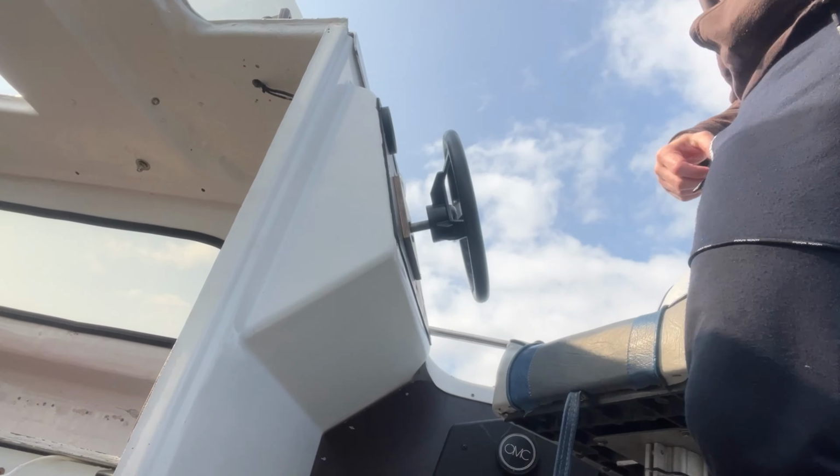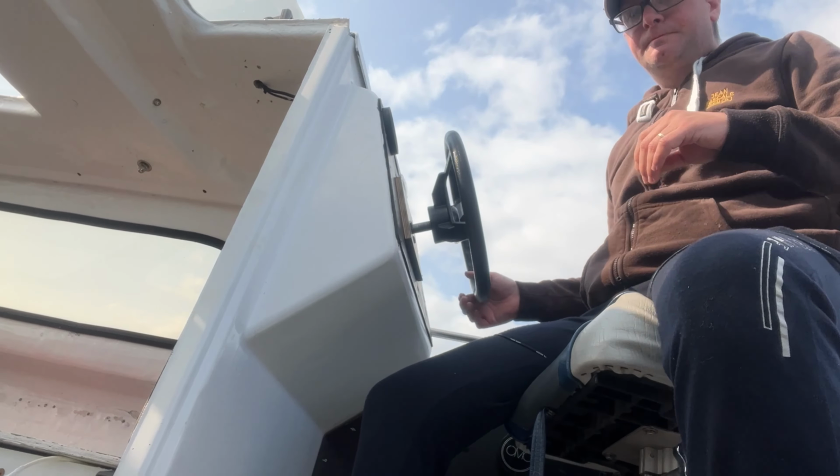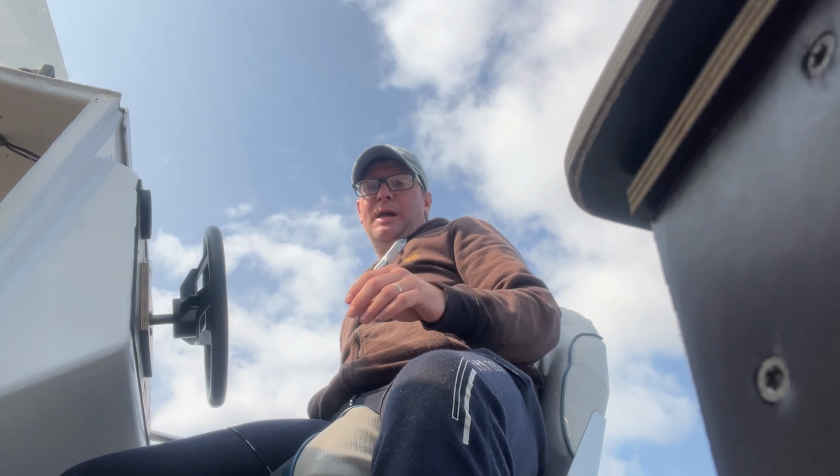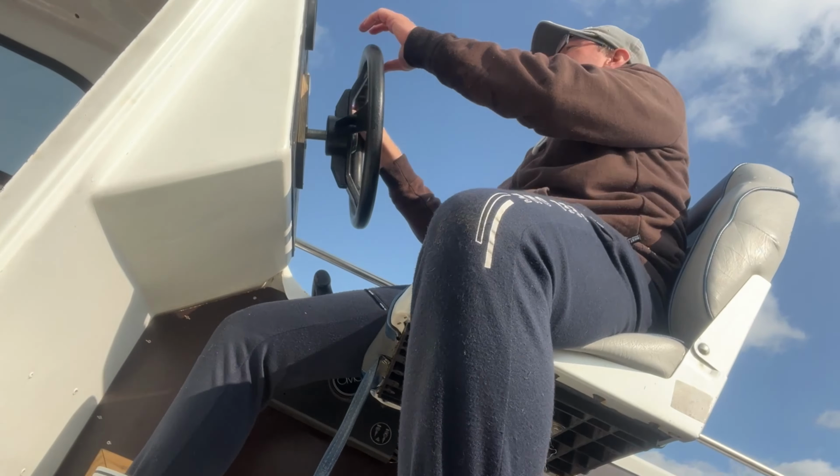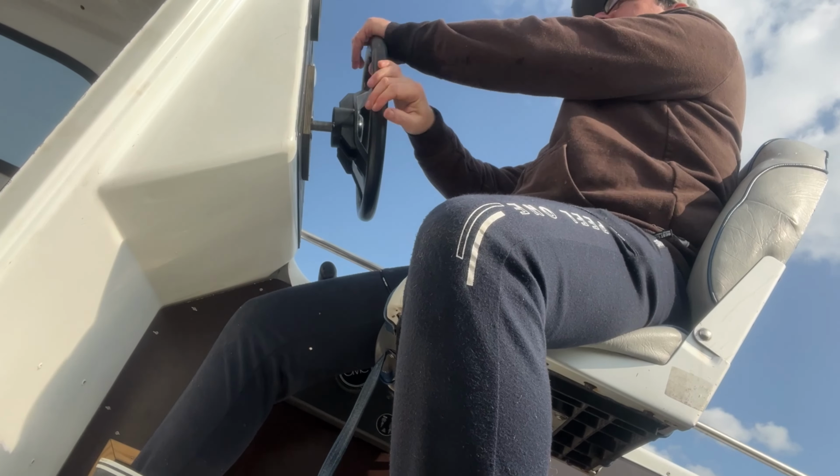It does not come to plane by itself. It actually needs me to move all my weight to the front of the boat. So now I will take the trim flaps, put them down and see how it will perform. And I hope that it will be better than the flaps on the engine. So let's have a look. I will put them on now. Okay, trim flaps installed. Let's start up. Try against the wind.